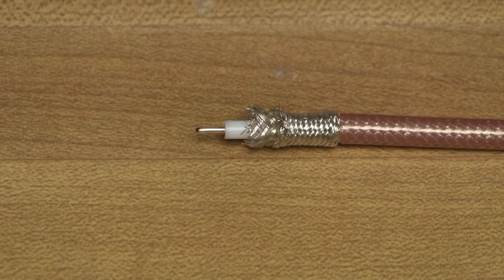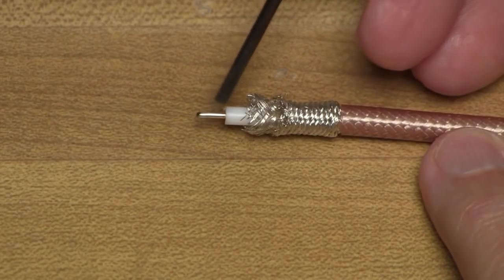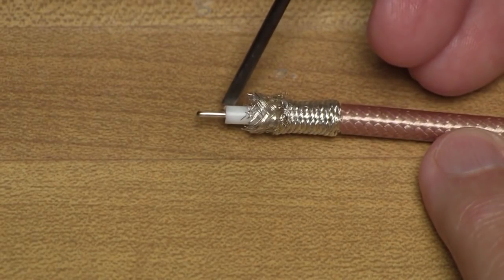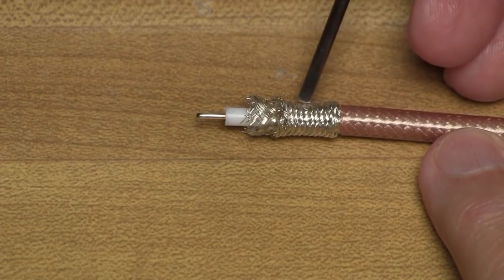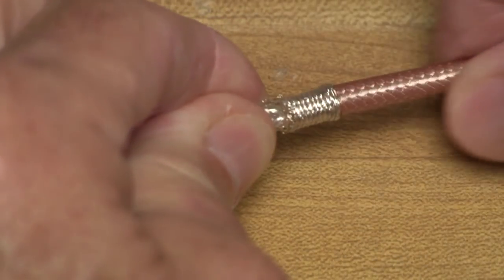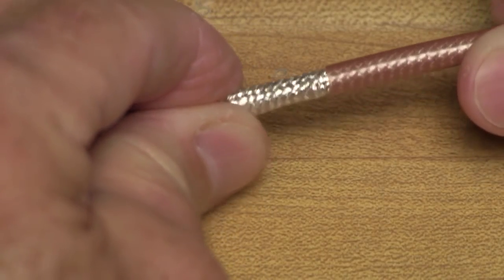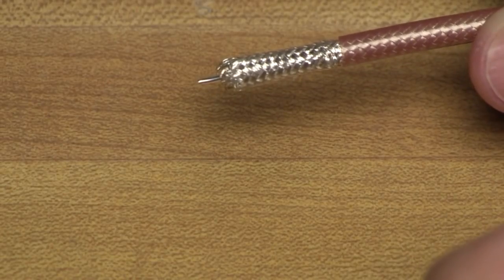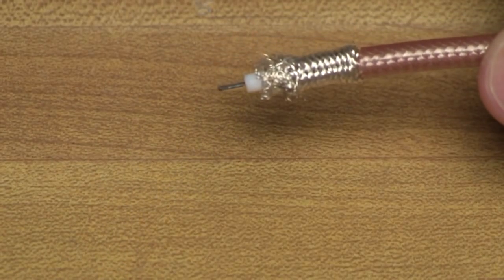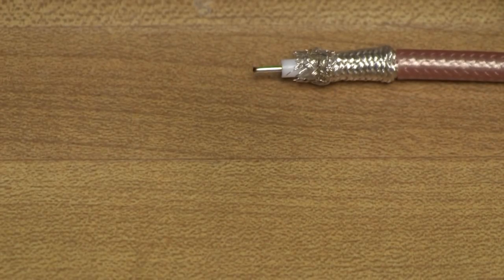The reason it works so well is the double shielding of the cable. The center conductor is a 19 AWG silver-coated, copper-covered steel conductor. It's plenum rated, has a Teflon dielectric, double silver-coated copper-braid shields with 95% coverage, and an FEP jacket. Because it's approved for direct burial, you can use RG-142 in underground connections and still have good shielding efficiency. The cable was specifically built for the United States military in World War II and is used for satellites, systems, and other tactical operations.